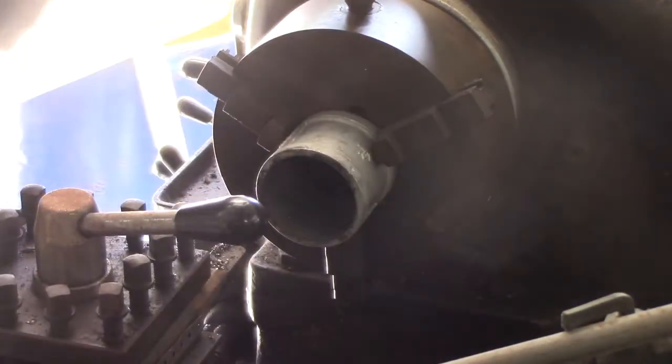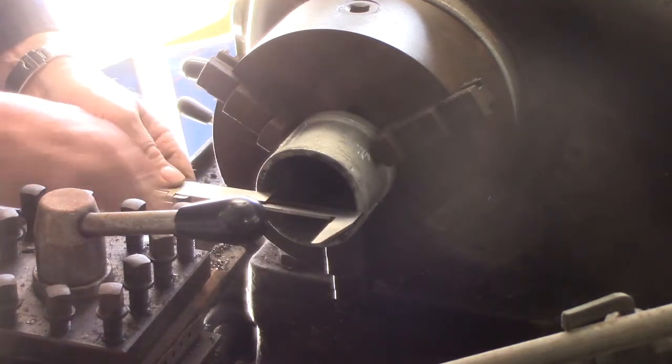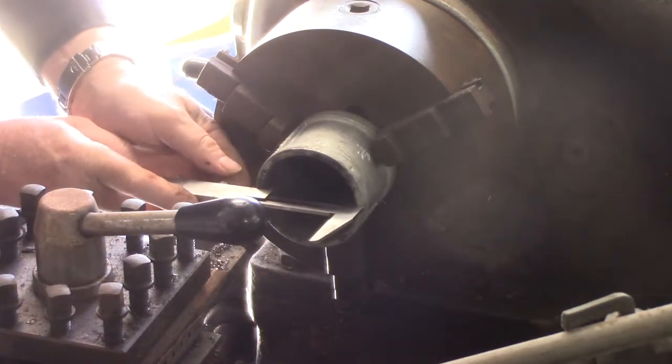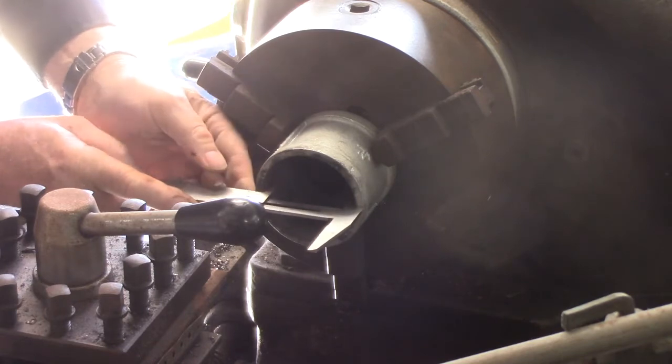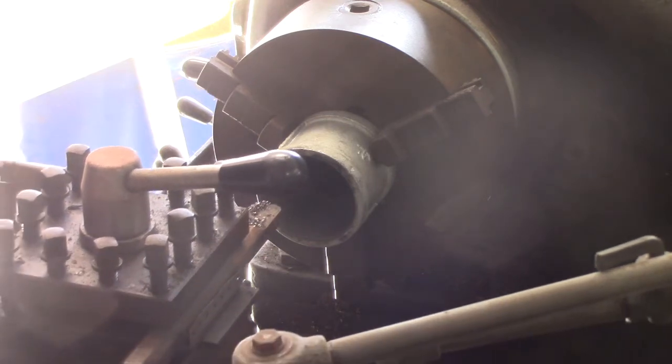The piece that's got to come in from the other end off the blower is a little bit bigger, a little bit asymmetric as well. I think it could be just the fit of him, because he made it in 2 halves and he bolts together. I think the fit of him's just not quite round. Anyway, the size of that is spot on 3. So we might have a bit to go off him yet. Yeah, we have. We've got about 25 thou to come off him. I'll take 15 and we'll see how we go.